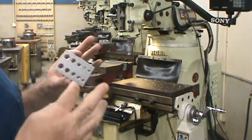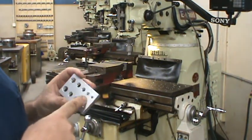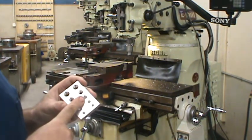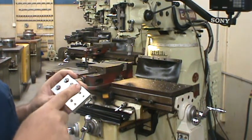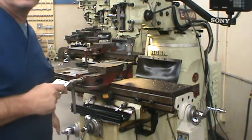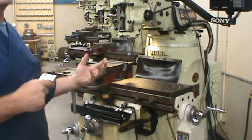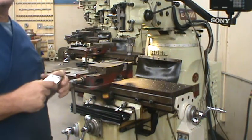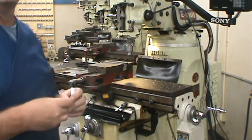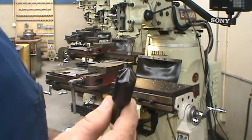I'm going to use a quick method to do this. In the original tapping operation — I think it's operation two for this particular part — going through spot drill, countersink, tap, I showed how you can use the table feed depth to bring the table up and the quill. In this demo, we're not going to do that; I'm going to do it by hand.